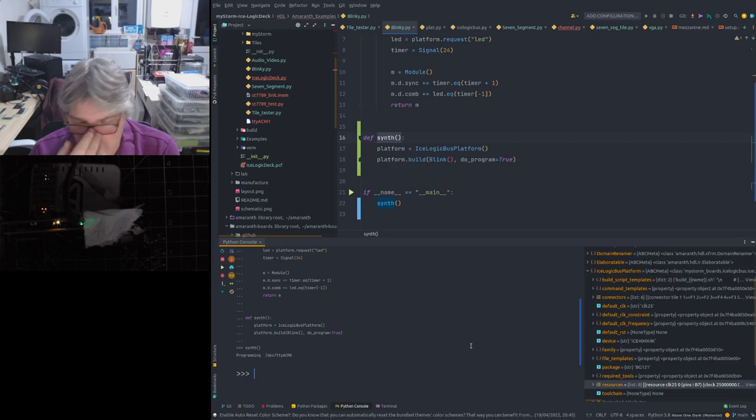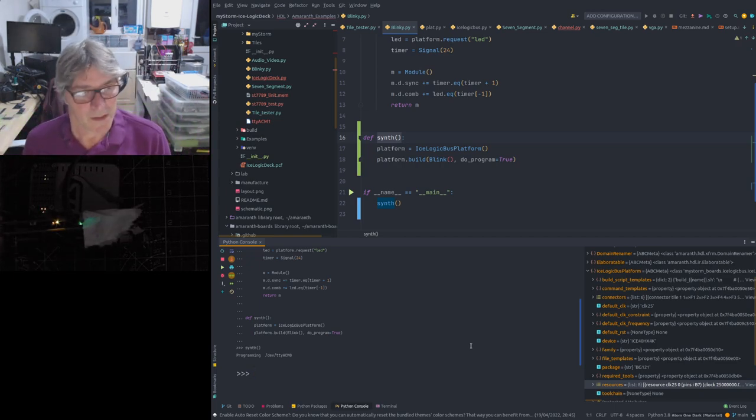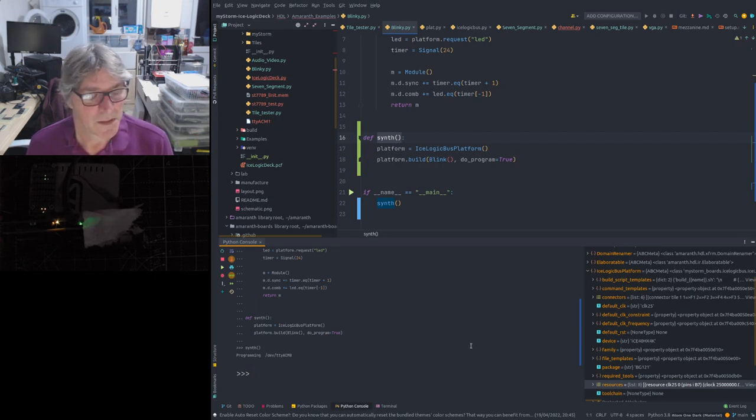And if we also do the QSS interrupt swap, we'll only ever see the green LED in programming or briefly on an interrupt until the interrupt is serviced, which could be another aid potentially for debug. So that's an obvious improvement I'd like to make on the next round. That's a fairly simple one to do.